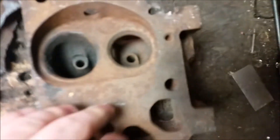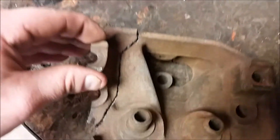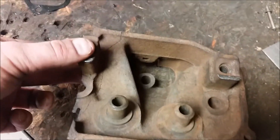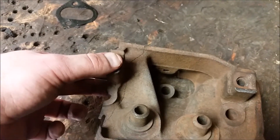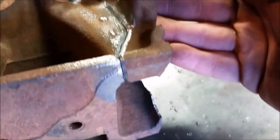This was actually a pretty good cylinder — the seats aren't too bad in this one. But what we're gonna do is clean up this cast iron like how you do to weld it. We're gonna V out everything — this piece is still hotter than hell. You clean those up, V them out, and then braze them together. We've done cast iron welding with the arc welder, but don't really want to use the arc welder on stuff like this. We got our V-groove cut out right there. You want clean metal and lay the material right in that V. This will be the test piece, and once the actual project gets here, hopefully one of us is good enough at brazing.